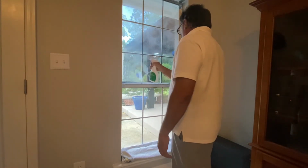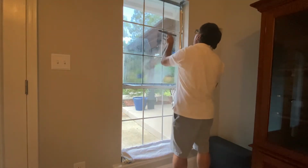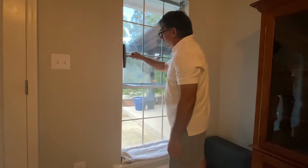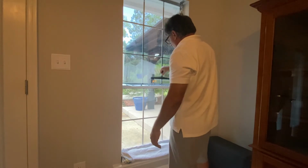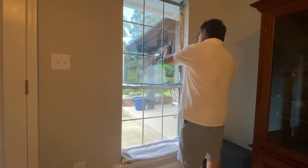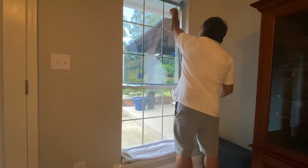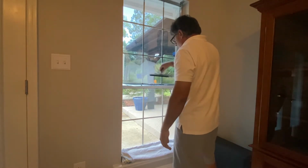Whenever I use the rubber-bladed squeegee, I spray the exposed side with the application solution to prevent damaging the window film with friction. My goal is to keep my 2 prepared sides aligned while lightly pressing out imperfections. Always press from the center to the sides. This prevents wrinkling. After the window film is smoothed out, I will make sharp impressions in the overhung sides.